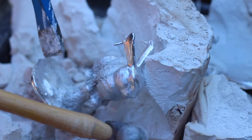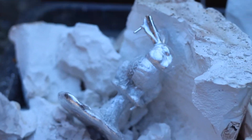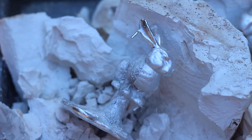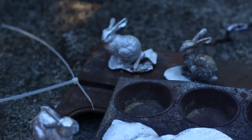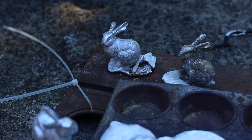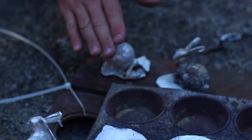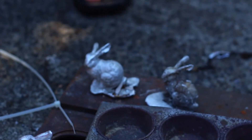So then how do you take off the air vents? You just grind it off. Yeah, there's a lot of mechanical work there. There is a bit of a seam there. There was no seam on the model — the mold cracked slightly internally. That's why I've been moving to adding a bunch of fiber.